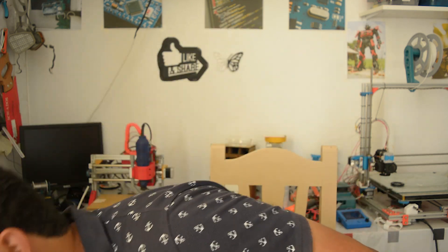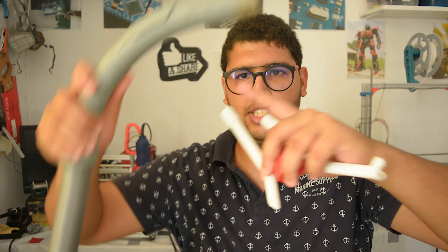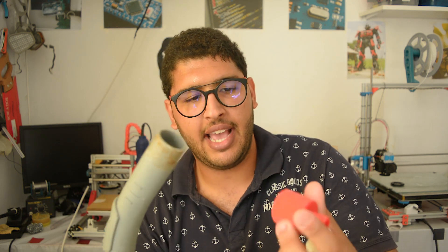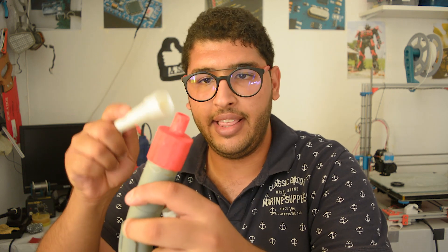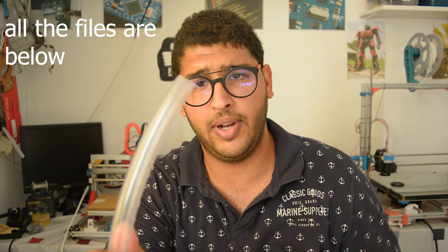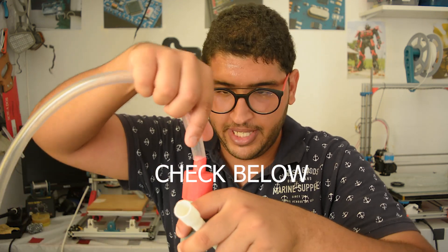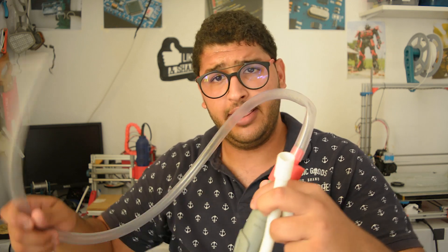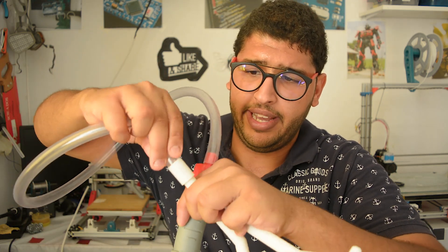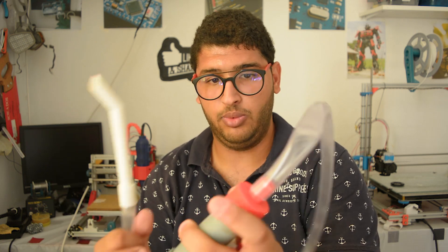Because I have a powerful vacuum — this one right here — and because it has this cylinder tube, I had to make an adapter to connect them. On the other side I used this water tube here. I will leave the dimensions on screen in both millimeters and inches. Basically it goes right here, and this part you just stick right here — it's a tight fit, which is how it should be. With this setup you can use your big vacuum cleaner to suck all the dust.